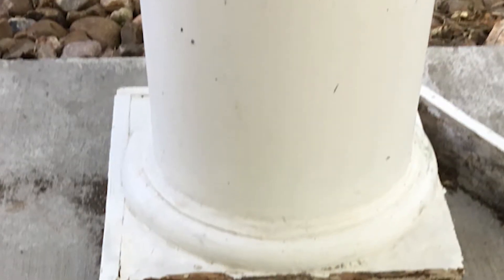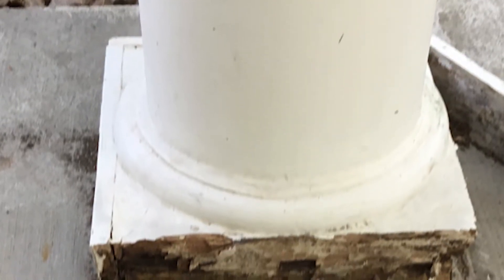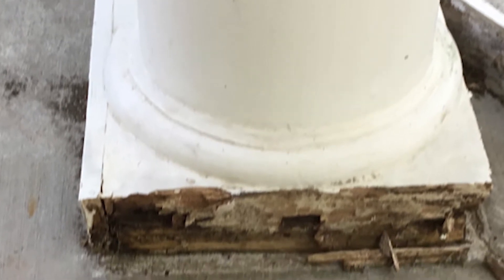If it's a separate piece on that bottom — I don't think it is, but if it is — you can just shore it up. It's little pieces. I think it's all one. Do you think the base is part of the post? Yeah, I got a little crack there. I think it was all bought as one piece from a mill yard. Then you'd have to replace the whole thing. I would think about changing the base of the column, cutting it off about a foot up and doing a brick base. If your house is brick and you can match some brick, it would look really good.